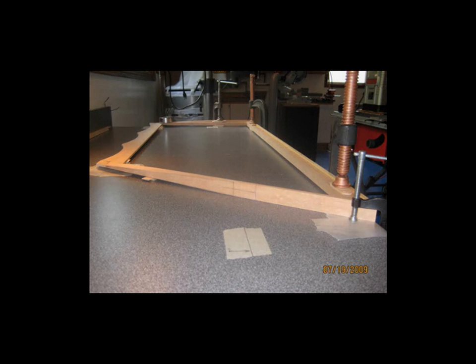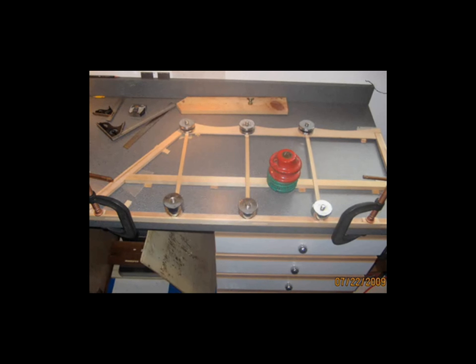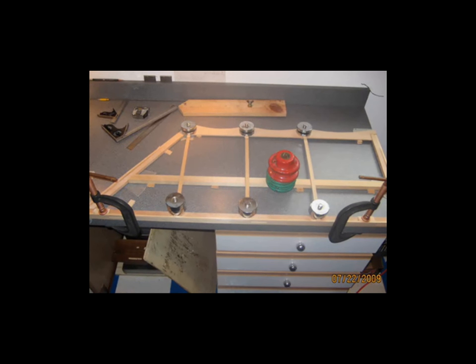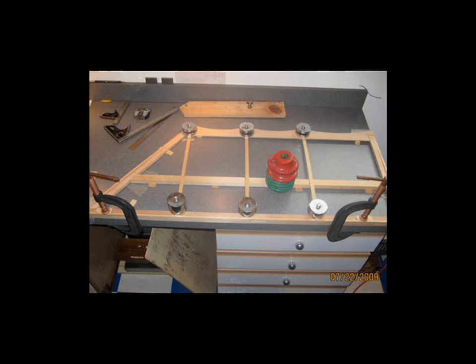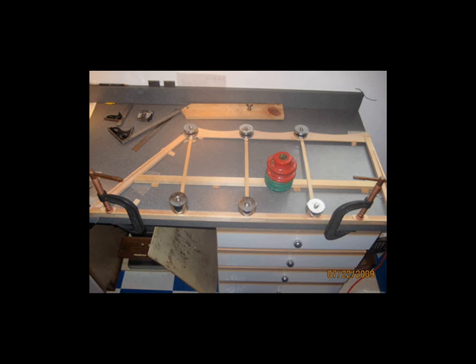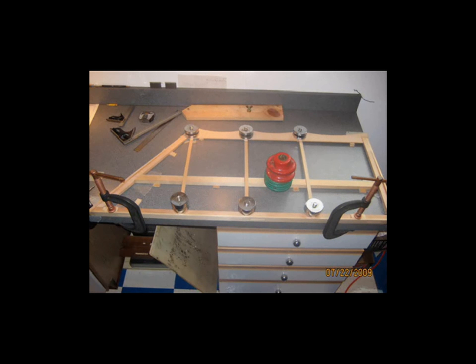This picture is kind of going backwards a little bit, but I wanted to include it to show the taper on the elevator. With my design-scale trailing edge being so skinny — which is the way I wanted it — this taper is more pronounced, and I just wanted to include this picture so you can get a better view of it. This next picture is the final picture of the finished product. The little weights are just to hold the stringers down so they don't pop up — there is a bend in them because of that main beam, but the weights are just there to apply some mild pressure to hold them in place. The other elevator will be a duplicate of this, using the same benchtop, the same tape, the same pencil mark, so it should come out exactly the same.